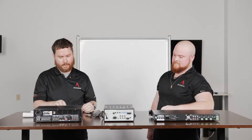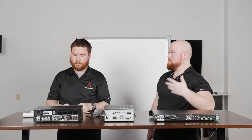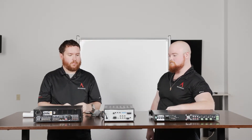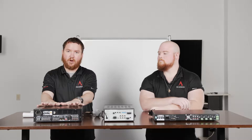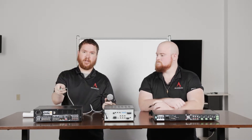So the mysterious method of trying to hook up a microphone to a 70-volt amp — there's been a lot of questions around this, we get asked all the time: what's the difference between hooking up a regular XLR cable that many people have hooked up to a mixer board at their church? Some mixer amplifiers, like our MA series, actually have an XLR input right there on the input section. That makes things very easy. Say you've got a wired microphone like a conventional live audio microphone like our UC1S — you've got a male to female XLR, you just plug it in. Away you go. So that is one option if there is an XLR input on the back of your mixer amp.